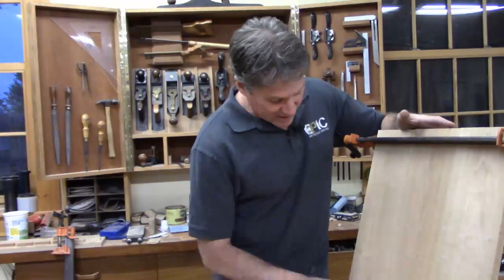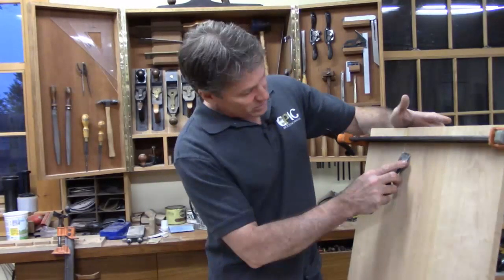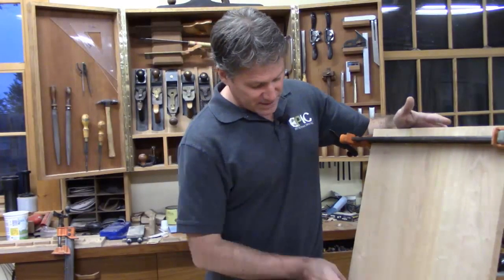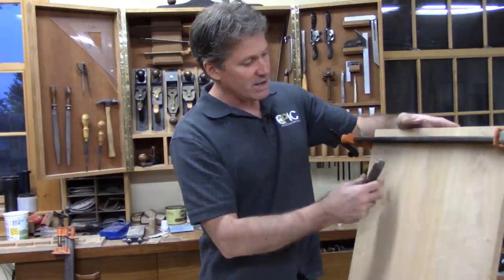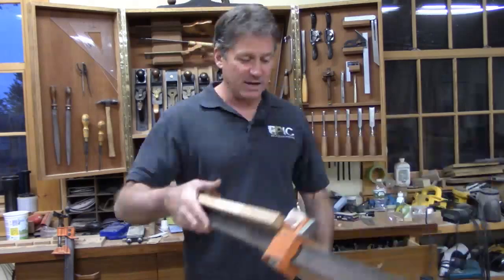Now these bar clamps are steel, so with the water and the glue, they leave a little black stain, which in this case, I will scrape on the bottom here just around that area, and these will get sanded heavily enough that it'll be gone, so I'm not worried about it. Prevents the black from getting onto the wood.